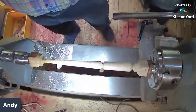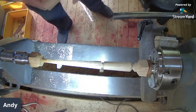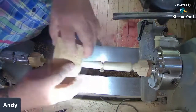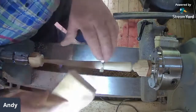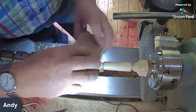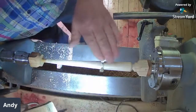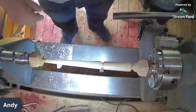I think that's as far as that side is going. A quick sand down — 180 grit, with a bit of sponge. I just find this helps give me some sort of control over it. Look at those marks all disappearing — the piece is chattering a little bit, it's so thin. You've barely got 6mm to support it. The marks disappear very, very quickly.